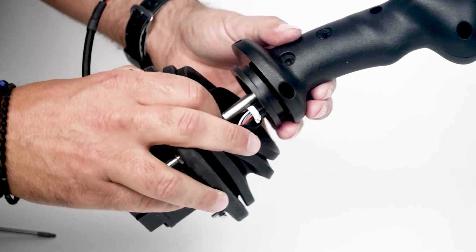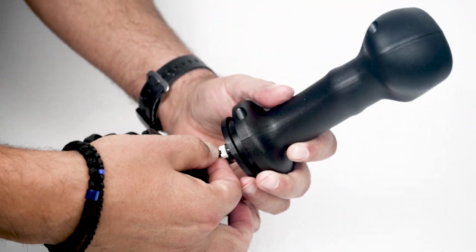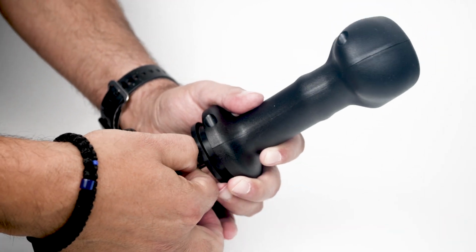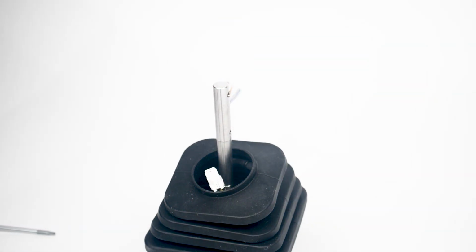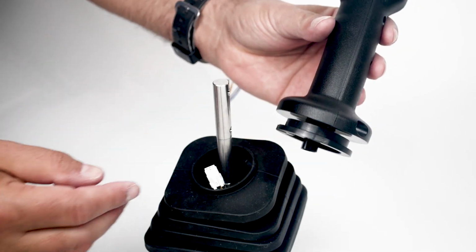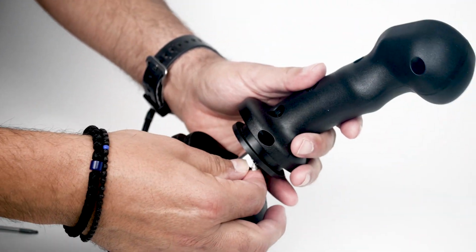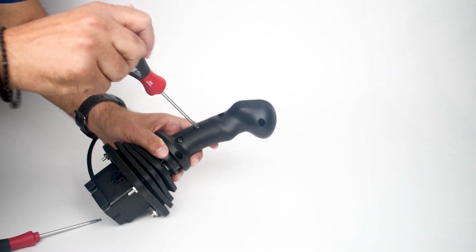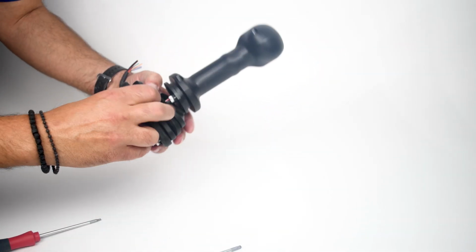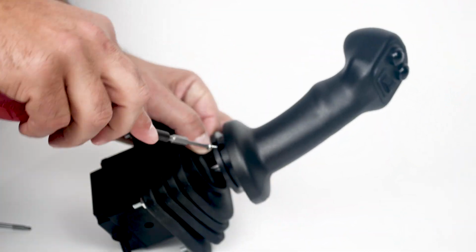Upon removal of those mounting screws, you can lift up the G3M and, again, with no use of any tool, pinch the connection and remove the grip. You can then just mount the replaceable grip handle onto the joystick, make the termination to the connectors, and refasten the joystick and terminating any strain relief that is also present in the design.